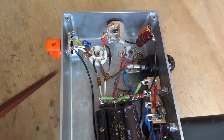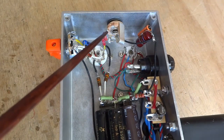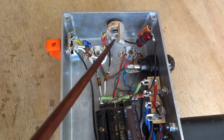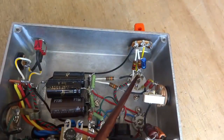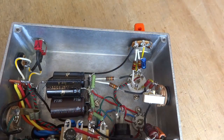At pin 2, this is provided through the 2 input resistors. A 33K resistor connects the input jack tip to the grid, and a 1 meg resistor connects the input jack tip to ground. The control grid at pin 7 is provided a ground reference by a yellow signal wire through the gain pot to ground.